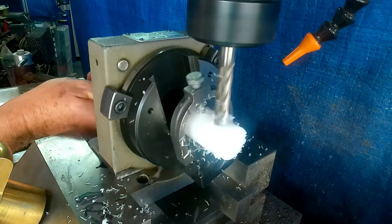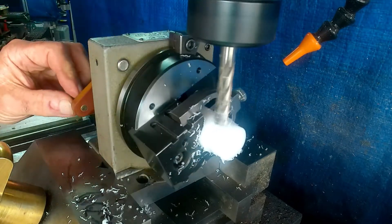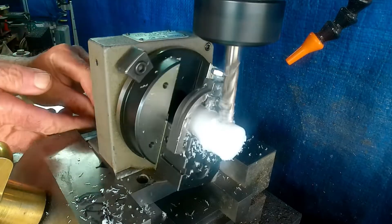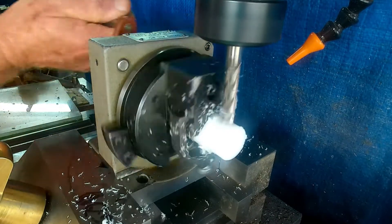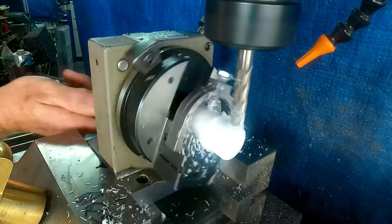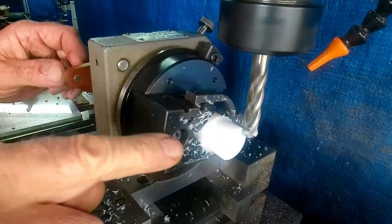About to the half-inch mark. Now the other thing to be aware of is that end mills aren't dead flat on the end, so we've actually got to make sure we've taken a bit more of the cut layer — go around there — otherwise you'd end up with a non-flat surface. Yeah, I think that's quite a reasonable finish.